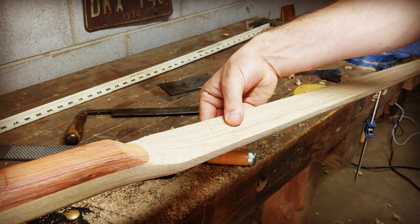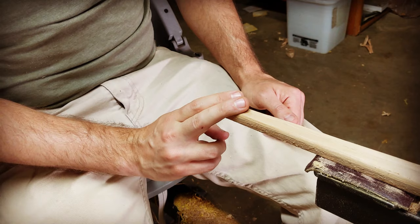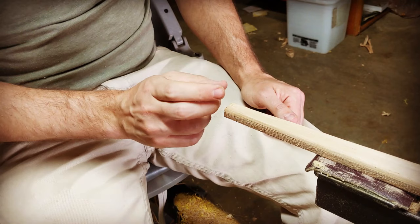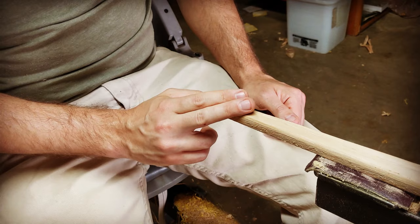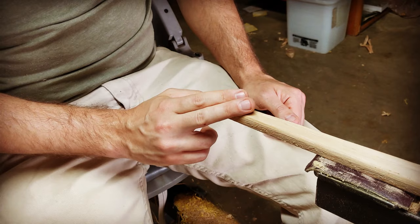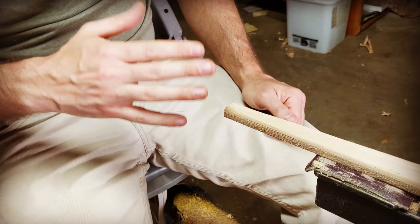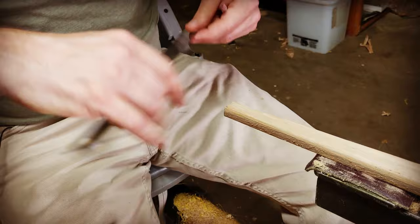Always remember to use your fingers between wood removal sessions to make sure your taper is remaining consistent. I did a little rasping on my inner halves and I like how it's bending a little bit more at floor tiller. The next step is going to be to put some string grooves in so that we can put a long string on it, put it on the tillering tree, get a better sense of the weight and how it's bending. I've chosen self-nocks for this bow to keep it simple.